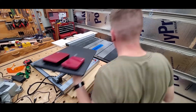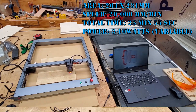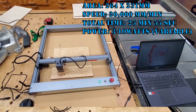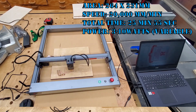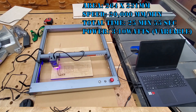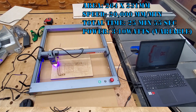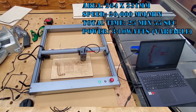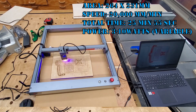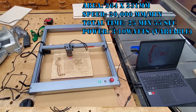Plaques are super easy to do. What I do is I cut my blanks and pre-finish them, then come back and engrave, and then seal that engraving — I find that gets me the best look. Pre-finishing is a little bit of risk because if you screw it up, you're screwing up almost a final project. Another way is to partially pre-finish: apply your stain, apply a basic coat of clear — I'll typically use lacquer, sometimes polyurethane — sand the main engraving surface to a final finish, then stain and seal, then engrave on top of that. Then I do profile and perimeter work. That way, if I don't get the engraving exactly centered, I can make that adjustment when I'm cutting. The cool thing about plaques is you can really batch them out, and if you have a good margin on them, you can make a lot of money.